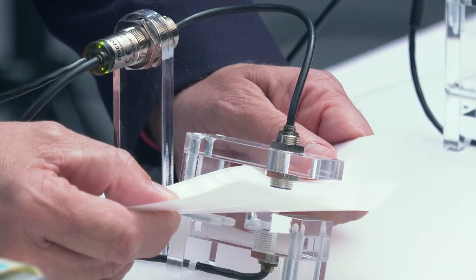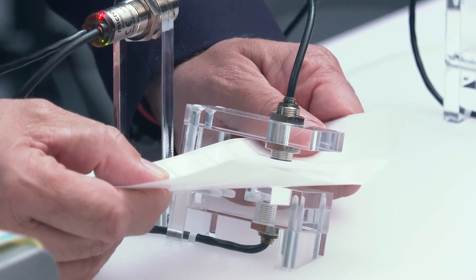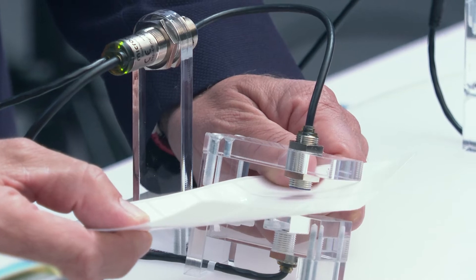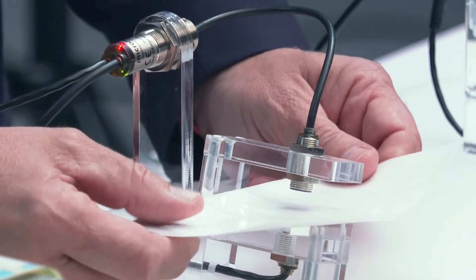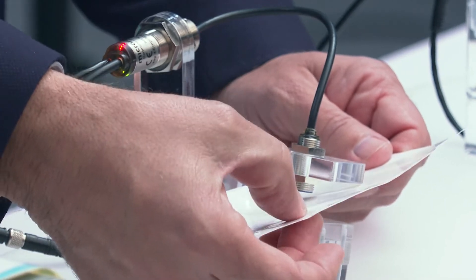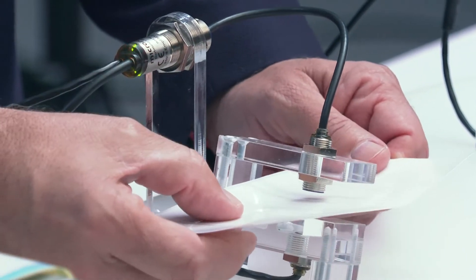You can see it here: I get red LED indicator 4. The label inside the gap changed to green. This indicates only backing material, and therefore now I can detect the leading edge of every label.